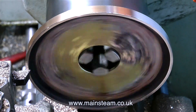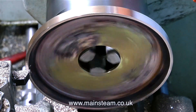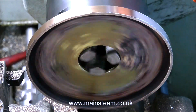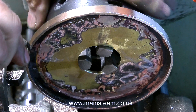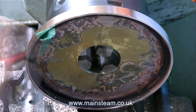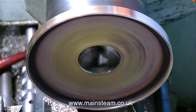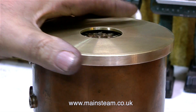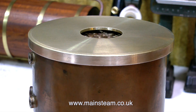What I'm currently doing is taking a very fine finishing cut across the front of the flange. Once I'd taken one fine cut, I took another fine cut coming back the other way. All that's left to do now is use a deburring tool to remove the sharp edge on the inside surface of the flange — I never like to leave sharp edges because I'll be the one who cuts my fingers on them first. I'm also using a piece of folded coarse sandpaper to complete the deburring process. And here is the completed top cap — looking rather nice, even though I do say so myself.